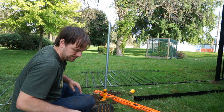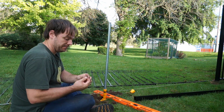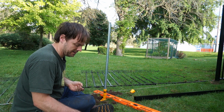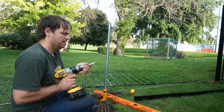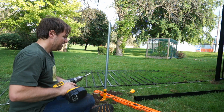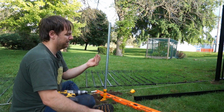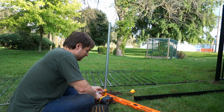And then they have a ton of screws. Different panels came with different screws. They have these nice little hex head screws that go in pretty nice. They've also given me regular self-tapping stainless steel screws for some of this, but the heads seem to shear off them. It's not in the instructions, but this is a 9/32 driver here. The instructions say to have, I think, a 5/16 on hand, but the 5/16 only drives the big hex heads. It doesn't drive the little hex heads. So you've got to have that on hand. So take that, drive it in.